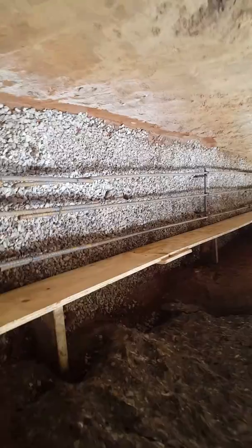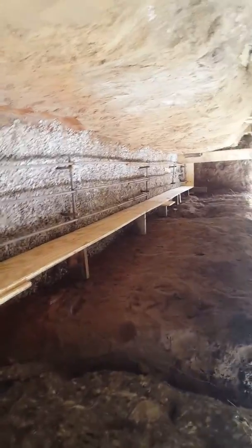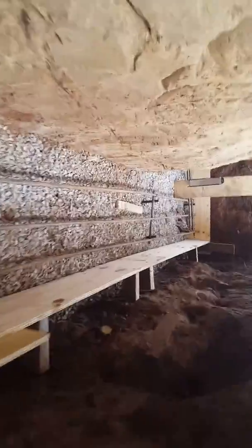We're here all the way around. I've got my form locked in, and as we can see, about every 5 feet or so, we've got rebar tied together on these cross braces to keep it up out of the gravel. You don't want it getting down in the gravel. And my guys are over there. Right now they're backfilling on the back side of this to give it some push, and we're leveling out this gravel that may have moved a little bit when we were walking.